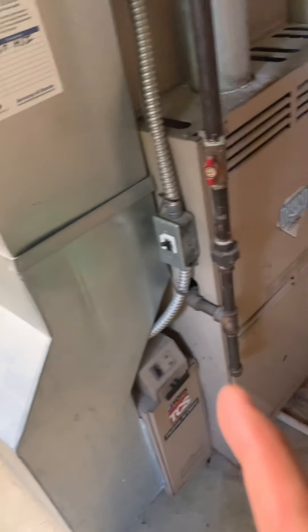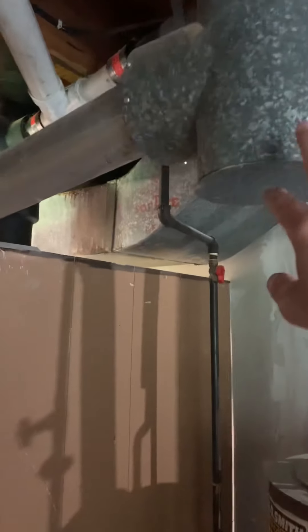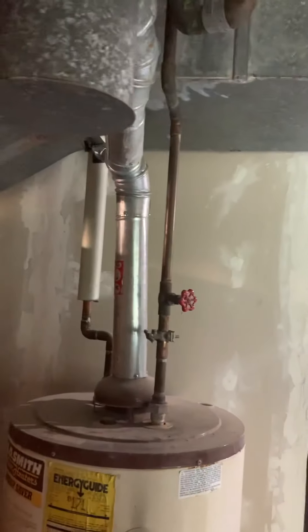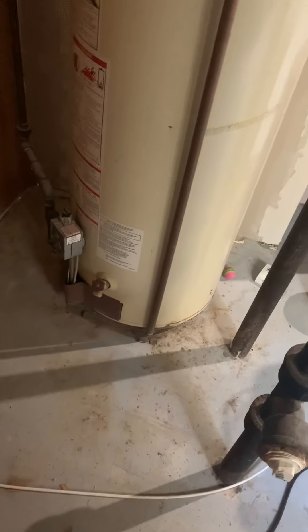Obviously a new switch, modify electric, modify gas, and flue piping — we want to get rid of this. We have a 6-inch T, so this will become just a single T, then probably 4-inch coming over and catching a new water heater and expansion tank, plus our new valve down here. We'll get quotes for 40 and 50 gallon water heaters.